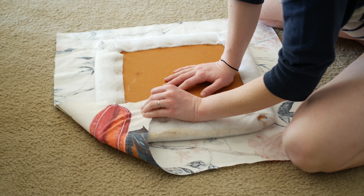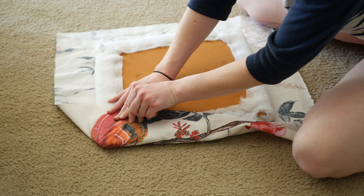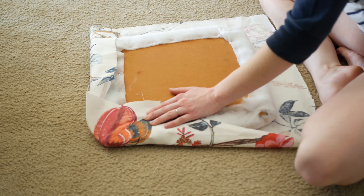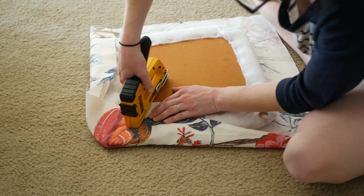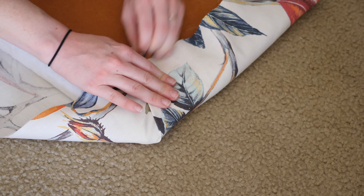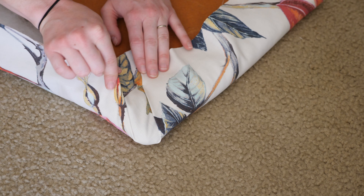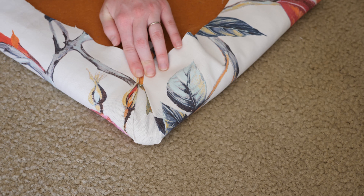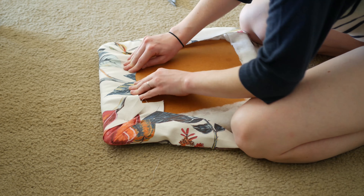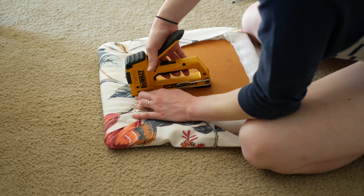Now for the most exciting part — stapling your gorgeous fabric of choice onto the base. Bring the corner of the fabric over the corner of the base. Fold the edges of the fabric in so that it creates a neat line. If this is the front edge of your chair, these corners and lines will be visible, so you want to make sure they're neat and even on both sides. Make sure there are no unwanted pleats or wrinkles in your fabric before stapling it down. Work your way around the base, making sure the fabric is tight and smooth, but not too tight. Repeat the same process on the other corners so that the corners all look uniform and neat. Make sure you're putting in enough staples to hold the fabric securely, especially if you plan on sitting on the seat. If you take your time and do it properly, this re-upholstery project will last years.